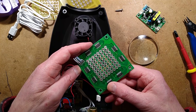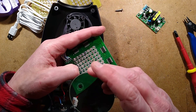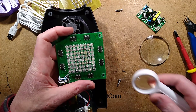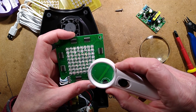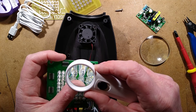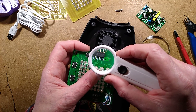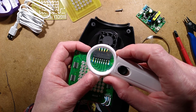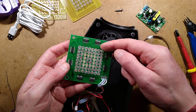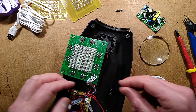MD-20131108 - so that's from 2013. What are these chips? I'll use this to magnify and find out - maybe I won't, they're really small. Standard TTL 74HC - is it 595D? You may be able to see that better. So that is driving the LEDs - basically there's a track from every single output of this to an LED. It drives the LEDs quite hard.